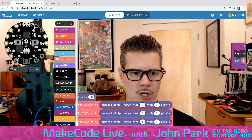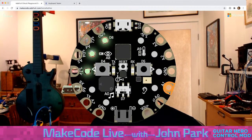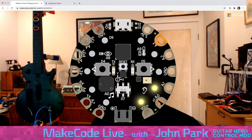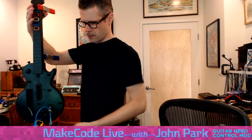You can see this in action in the simulator. If I press pad one, we get green pixels for button one. Two is red, three is yellow, four is blue, and five is orange. The orange looks a bit yellowy — orange is hard to do on LEDs, the defaults don't actually look as great as I want. You can see it's threaded — it allows button presses to happen during other button presses. I can press a whole bunch at once and it registers instantaneously.